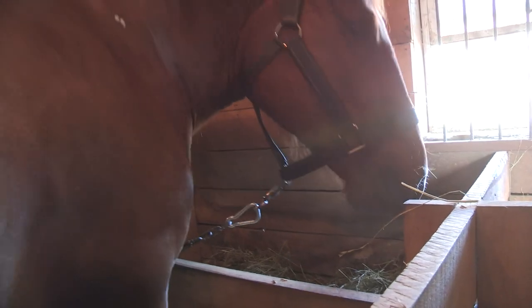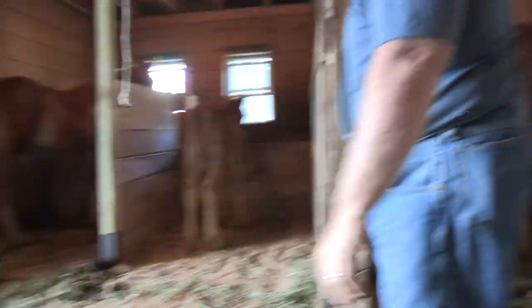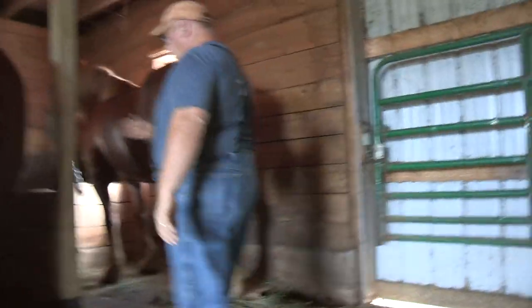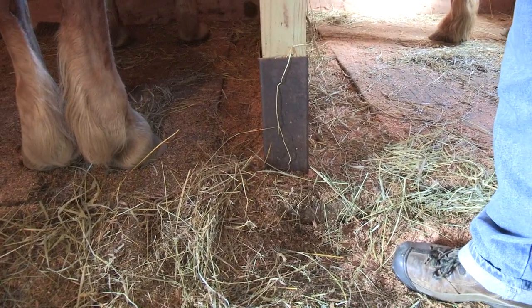These horses work together, so I don't have a stall divider grid in here — though at some point we might put one in just for aesthetics. My stallion stall I made a little bit taller just to prevent him from monkeying around. I apologize for the manure. Before, I would drill a hole in the concrete, put in a bolt, then mark the post, drill up into the post, and set the post on the bolt.